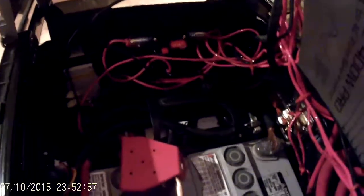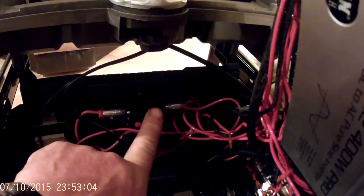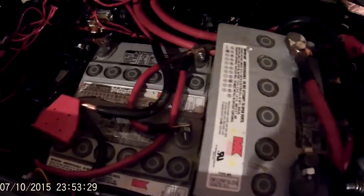Here's some of the circuitry I've got going in here. There's a lot going on, but I was pretty serious about trying to make it as safe as possible. Here is a 30-amp breaker for the solar coming in, so I've got a way to cut that off coming straight from the plug. And down in here I've got another breaker set up for putting power to the inverter.